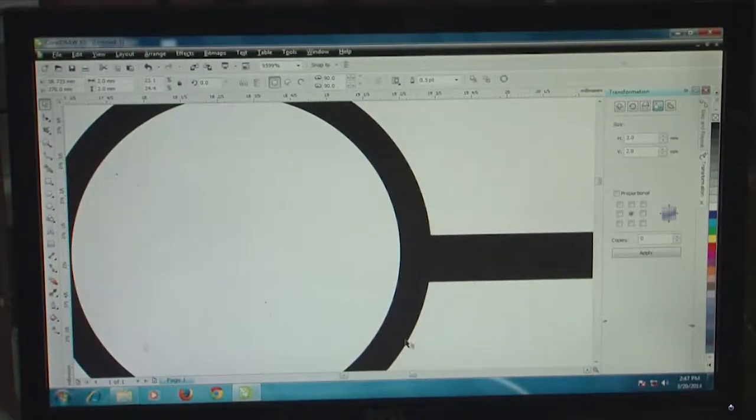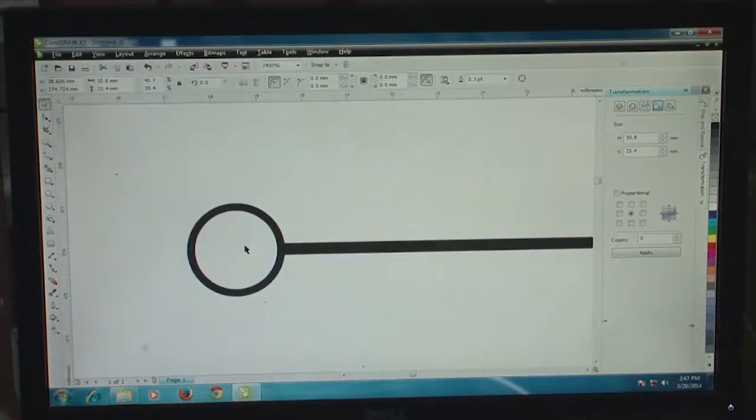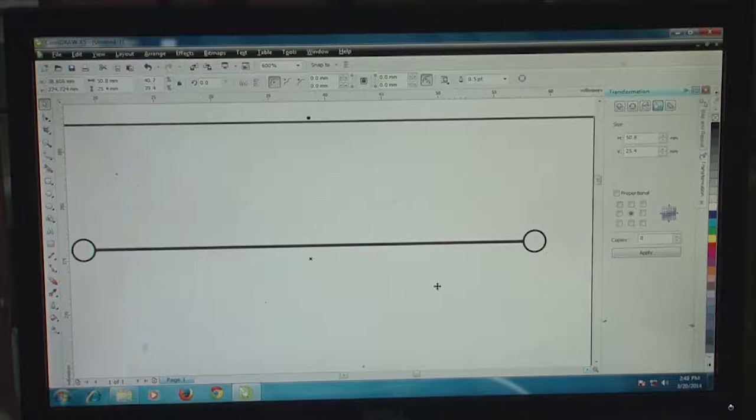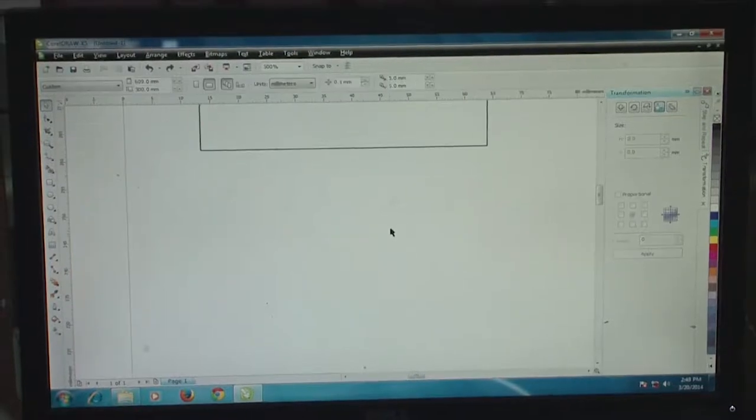Okay, so here I can again make a selection and try to align it more or less with the center of this channel, and so we now have a feature which is like an input output microfluidic channel of about 1.5 inches length and 100 microns diameter. So once we are set on all this, we can actually use control and cut.